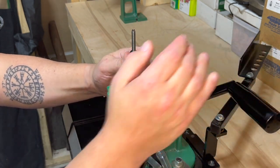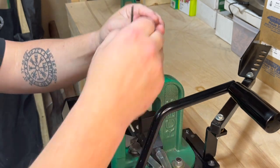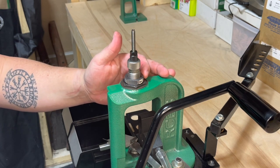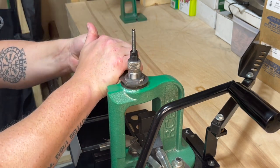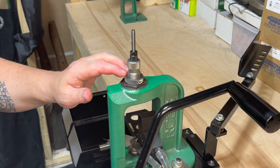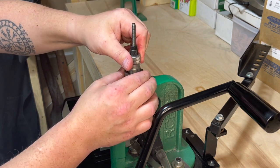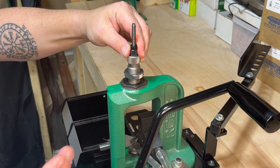You're going to do this on your steel dies. Once that's in place, go ahead and lock the locking ring. Once you've tightened your locking ring allen screw, now it's set. The nice thing about the Hornady locking rings is that you set it and forget it — you can take it out and put it back in and it'll be in the same place as you had it last time. You never have to worry about it again.